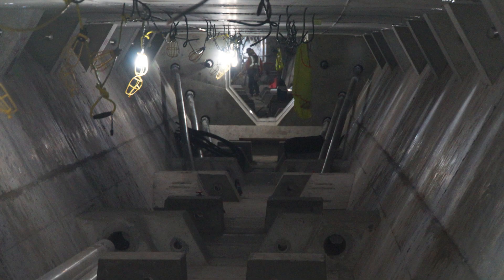You can also see a different form of post-tensioning ducts here. This is the Hawaii Light Rail project, but this is a precast segmental bridge. You can see the post-tensioning ducts in the back that are not in the concrete — they're separate, flaring off at an angle; there are six in the back. In the foreground you can also see what looks like pipe, which is the post-tensioning duct, and then the holes in the small pieces of concrete called blisters, which are going to hold those post-tensioning ducts.